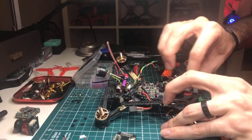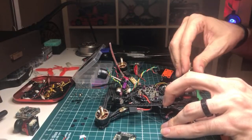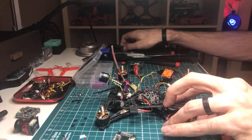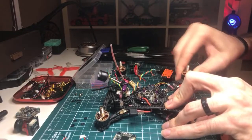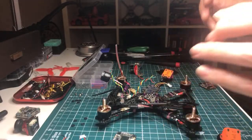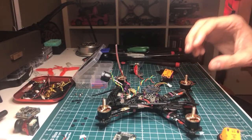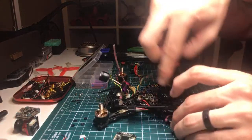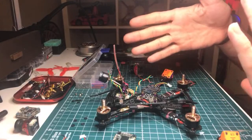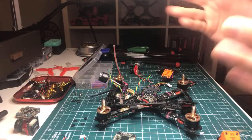So you've got the arm creating a frequency, you've got the motor and prop creating a frequency. If you put this whole setup on some unknown, whatever the durometer, whatever the hardness, the squishiness of TPU is, that can potentially create another frequency of vibration that's going into the flight controller, which already has its hands full. RPM filtering has either 3 or 4 individual filters that it applies to each motor. So potentially that could totally fix that, and maybe make soft mounting worth it again, I guess. But who the hell knows? We'll figure that out down the road.